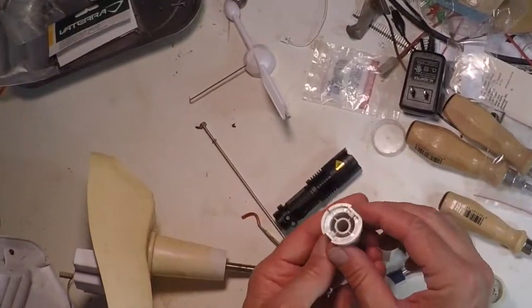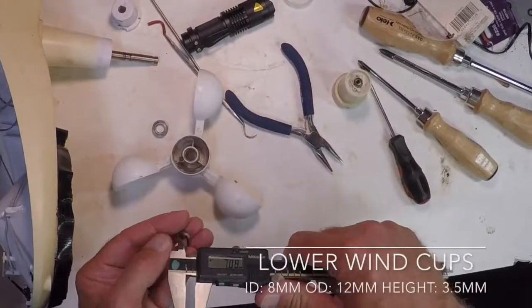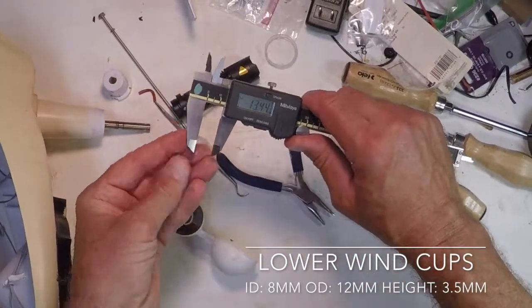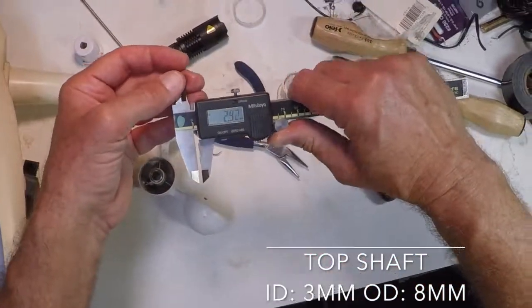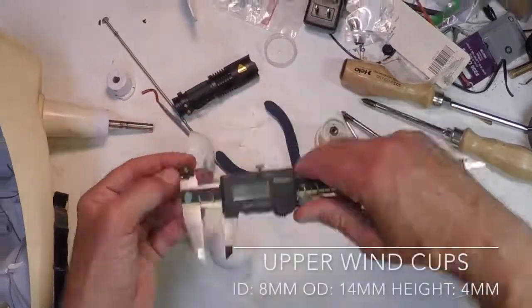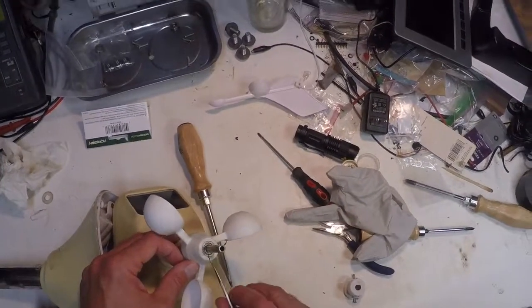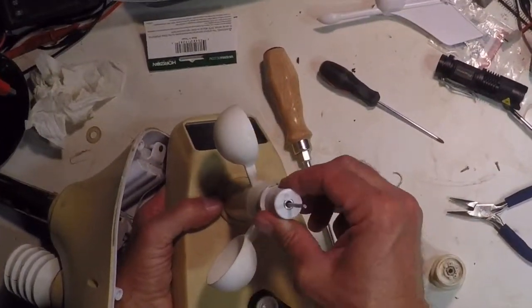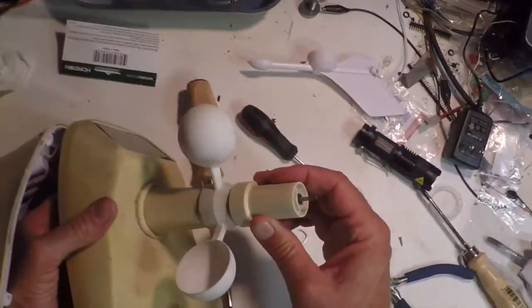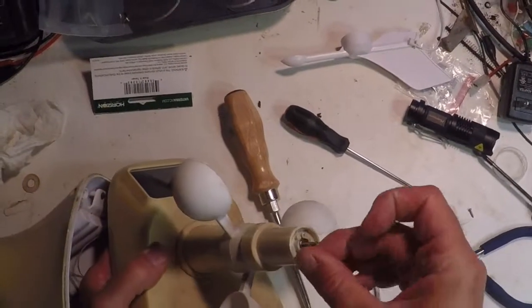Those are the three that I had to replace. I'm going to pull those out and then start to take measurements of them. With the new bearings in place I started to reassemble - I got the wind cups on, put the snap ring on, and these other pieces of the stalk just simply slide on. With this piece I had to put the snap ring back in place and I had a lot of problems getting it on partly because when I'd taken it off I'd bent it a little bit, so I had to bend it back into place to make it work.